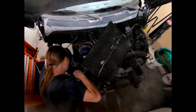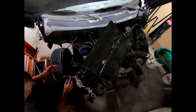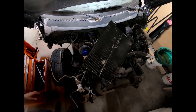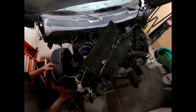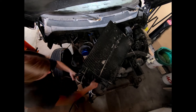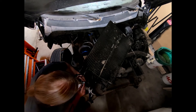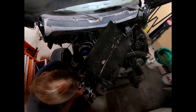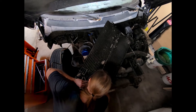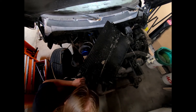It was under vacuum, that's why. Hold that big vacuum on this stupid system and I'm gonna come apart. Note for next time: after the refrigerant comes out, make sure to equalize the pressure again so it doesn't suck the fittings on.